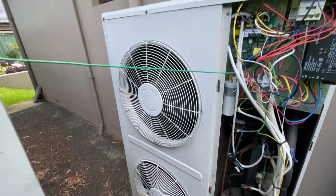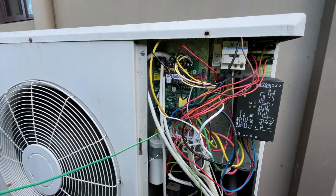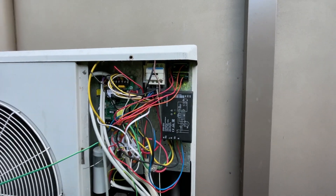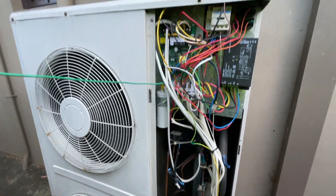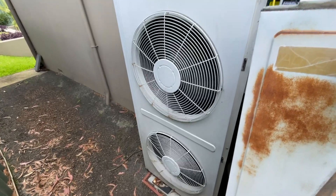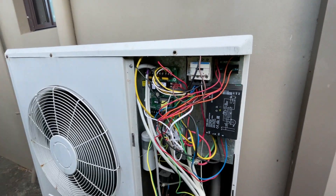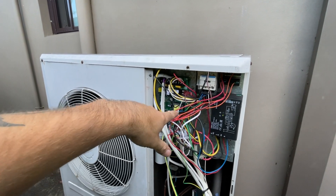So that's back up and running now. Just ripped out all that stuff that was there, put a new board in, wired it up. Still using the soft starter, contactor, fuse and whatnot. It's an old unit, and it's still cheaper to get it up and running than it is to replace it. I just wanted to make sure it was going to work, but I'm going to tidy all this up then close it up.